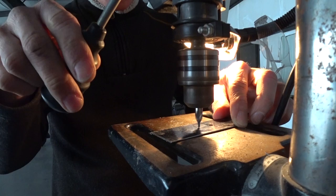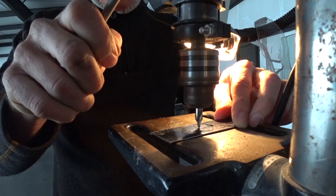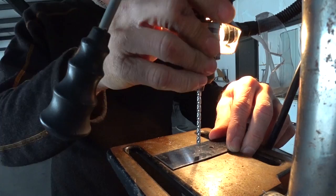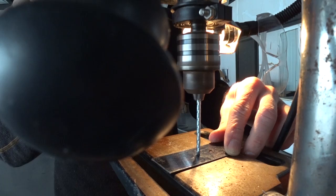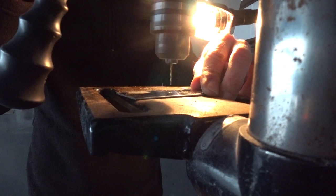So I was prepared to give that a try, but started out with the centering drill just to get a little bit of a hole going there - not that this can drill through there, but at least to put more of a starting point in there than what the transfer punch or center punch did. Here we go, and it looked like it was doing something for a little bit. This is sped up right now, but really it didn't do much at all, and I just didn't want to force it too much and get the metal too hot and make it impossible to drill.